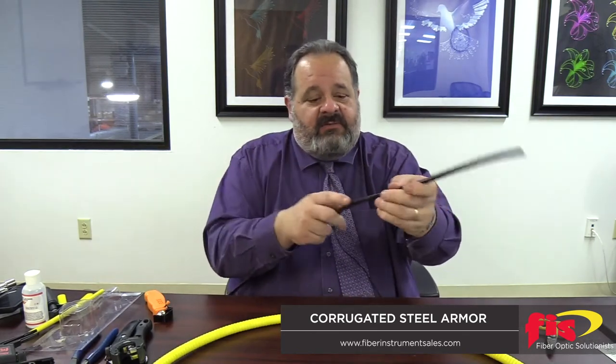We don't want our cables in a heave area where rocks tend to travel through the cable as it freezes and thaws. A good rule of thumb is to bury below your frost line. Here where I live it's three feet or deeper; some areas require two feet or 18 inches. Know your local frost line.